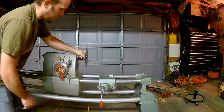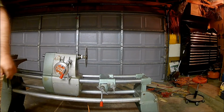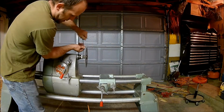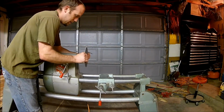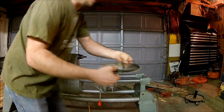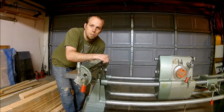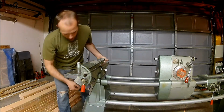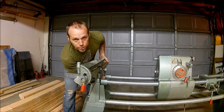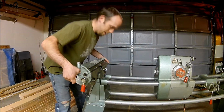With the headstock, I want to pull the saw blade off of this before I do too much with it, so we'll do that first. And that's just an Allen screw on the chuck for the saw blade, and then you can slide that right off. Alright, and I still got the joiner here on the end, and it's the same procedure for removing that table extension that we removed on the other end. I'm going to put some cross leverage on this and just reach under and loosen that screw. And then we can just lift this off.